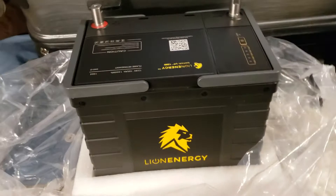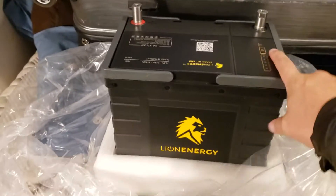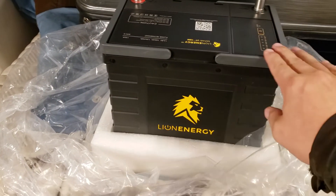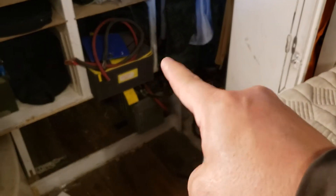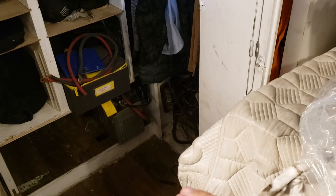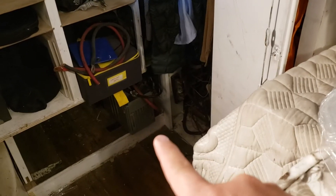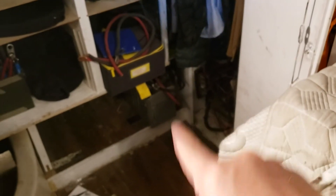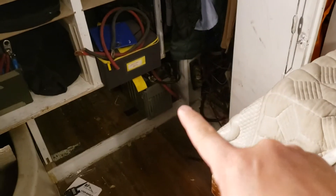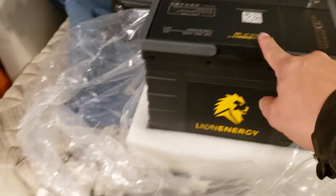If you're geeky like me with this computer setup, I'm running at like 20 to 25 amps with the computer. So those would give me, in a perfect world, 150 usable amps — but because they're now a little old and because AGMs are 300 to 500 charge cycles, maybe, the lithium is like 3,000 charges. You'll want to double-check the numbers on both.